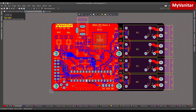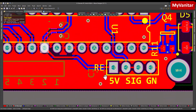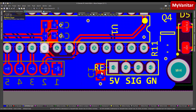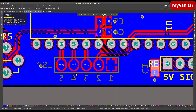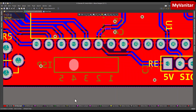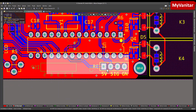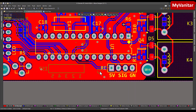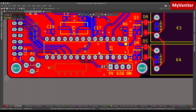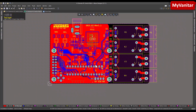I think I covered all the PCB points. I also made two minor modifications compared to the first prototype: I moved a decoupling capacitor from the top layer to the bottom layer, and I moved the ISP programming interface connection to the bottom layer as well. This is because some receiver modules are shorter or longer, so this modification allows you to use a variety of receiver modules here and gives you more space — since these modules vary in quality and stability.